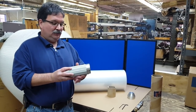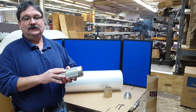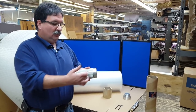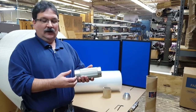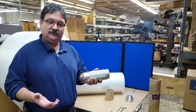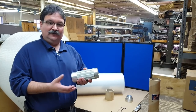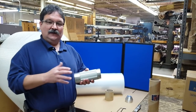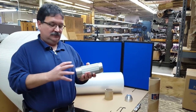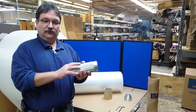CAC's Air Chucks are available in longer lengths. This is our standard length — a 5-inch expanding length, so the leaves that come out are 5 inches long. The overall length of the chuck is 7½ inches. We can do lengths up to about 120 inches. When we do longer lengths, we just term it as an air shaft instead of an air chuck. An air chuck and an air shaft have the same construction; it's just that an air chuck is a standard dimension — 5-inch expanding length, 7½-inch overall length for the 3-inch.